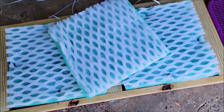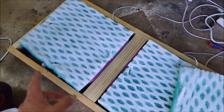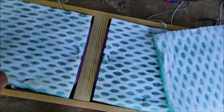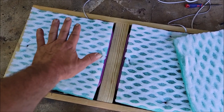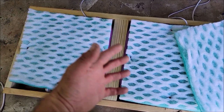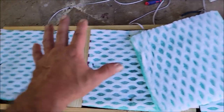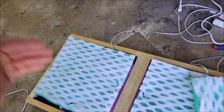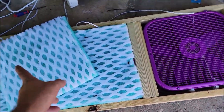I got my four quality air paint booth filters and I'm just mounting them to the backside of the rig here. They're supposed to be mounted so that the overspray hits that 3D section first, then through the green, and then there shouldn't be a whole lot extra. But what does get through hits the fan — this prevents your fans from getting all nasty and prevents a ton of overspray going out into the environment.